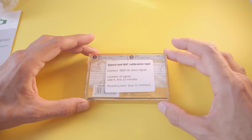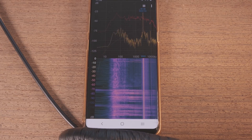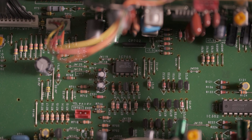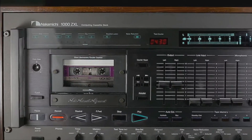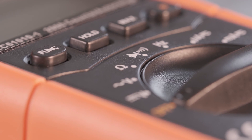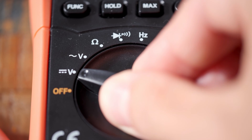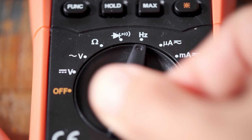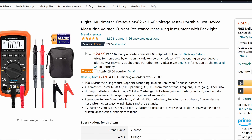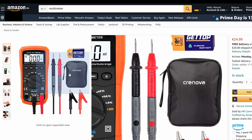For Method 3, we will use the same 3000Hz calibration tape, but instead of using our smartphones — which would be a bit inaccurate due to external sounds and microphone quality — we are going to measure the frequency of the signal directly from the output of our cassette player. This better serves people with high-end devices looking for very precise adjustments. For the task, we will require a multimeter, an electronic gauging instrument that combines several measurement functions in one unit. A typical multimeter can measure voltage, current, resistance, and frequency, and they start at around 25 euros. I bought mine from Amazon — it came with two pairs of test leads: one with tip needles and the other with alligator clips, both of which came very handy for this test.